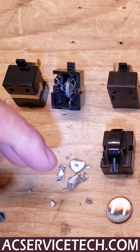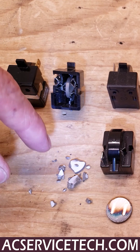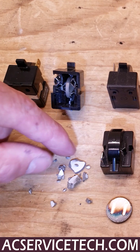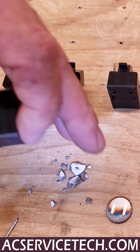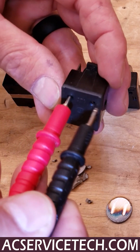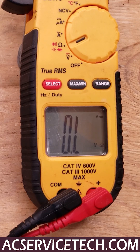You can see that one was bad. When it is bad, you may read a very low resistance value because you may have a chunk across there, or the contacts themselves are actually touching. And in this case you're reading no resistance value whatsoever.